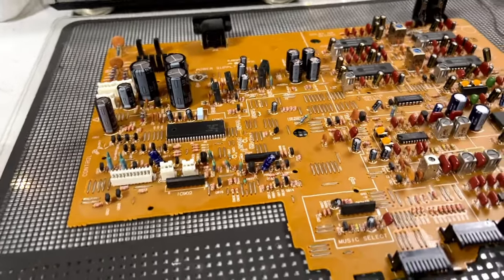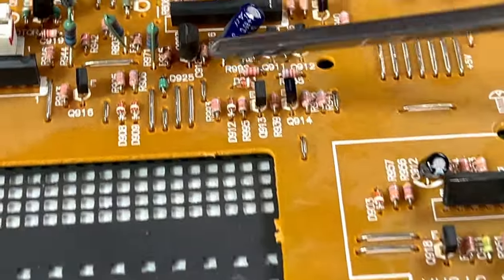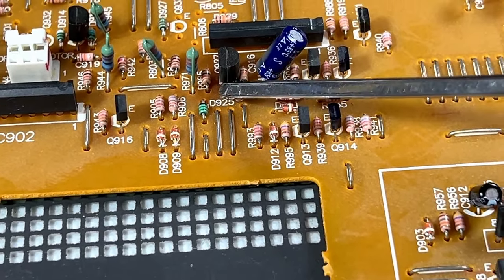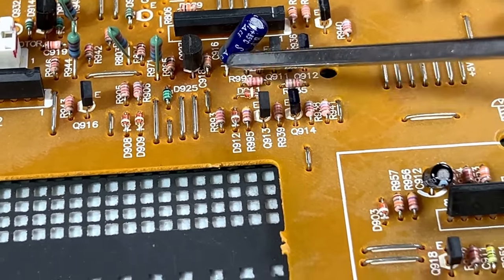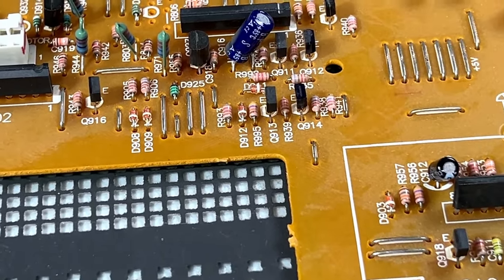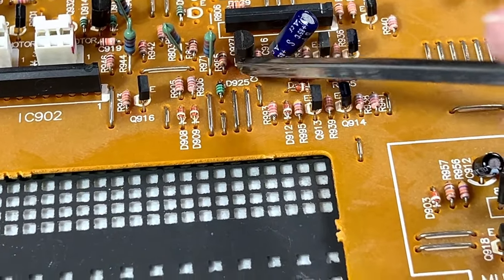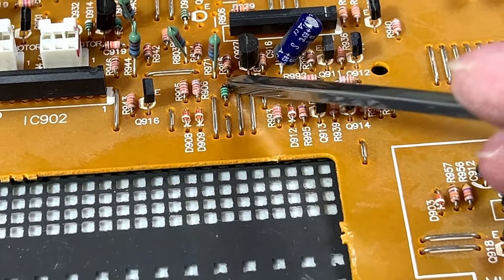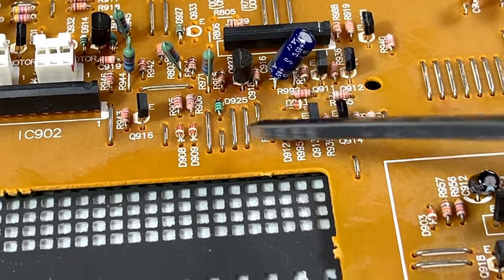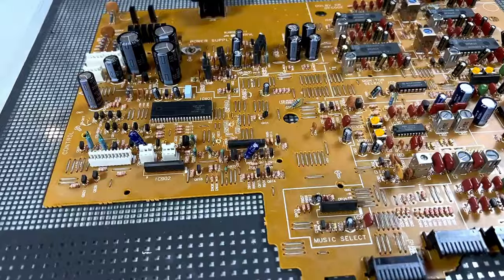And I found an issue while I was under there. You see this discolored spot under this transistor? Well, I found bad solder joints under there. Not batter solder joints. I've got fish and chips on the brain or something. Anyhow, this apparently has been getting hot for a while now, so I retouched those joints, and hopefully that transistor has a nice long life now.